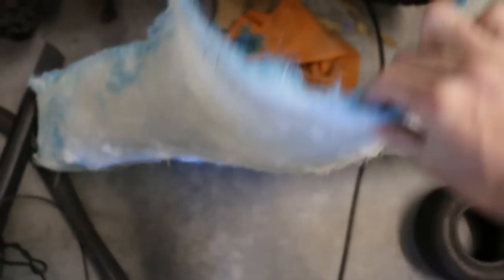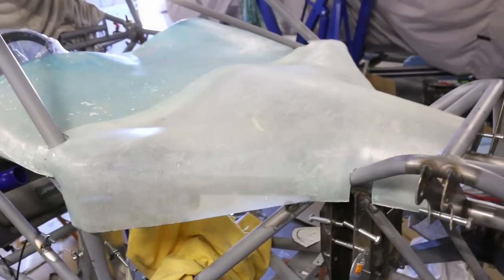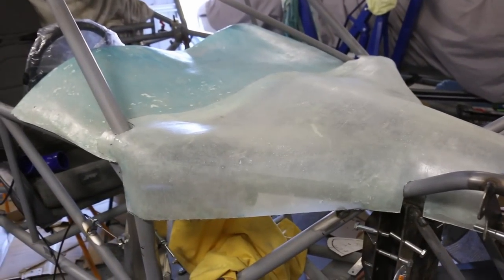This bonnet piece here is nice and white because I let the PVA dry long enough. Here's an example of a different way you can make a mold using chop strand mat. I don't like chop strand — it's quite messy and very cheap — but it does well at getting around sharp corners, so you can make parts like that without too much difficulty. Thanks for watching, hopefully this was useful, and I'll see you next time.